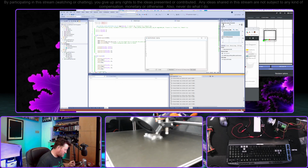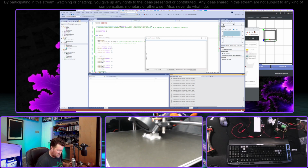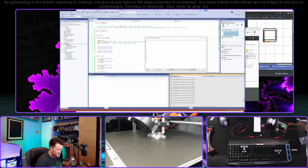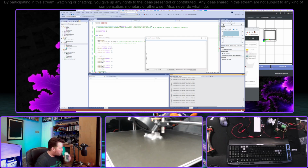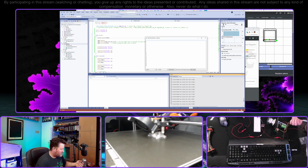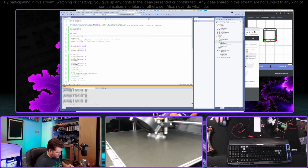And then beyond that, if all of the switch wiring is direct wiring, that makes that a lot easier too, because then we can just use the same switch contacts to detect when the pop bumper spoons are activated. And if not, there's always a way to snoop it. Worst case, you could detect when the coil fires. Seems like overkill, but okay.